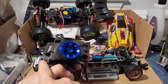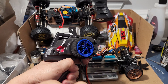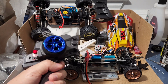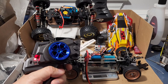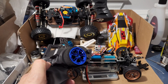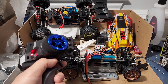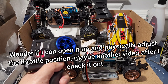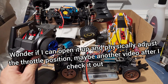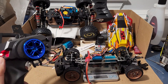I'm going to show you how right now. Throttle, go back a little. Power on. Turn the knob. See, the delay is pretty much gone. Now there's one problem — when you turn it off and turn it back on, you bind it again, and it's back to that same old delay. Well, at least it's something. So when you go out and play, do that little trick and it will help you out.